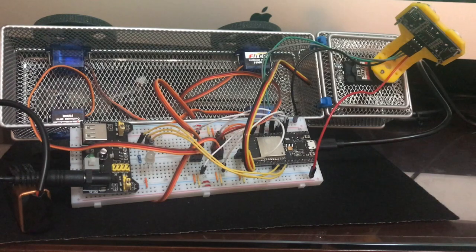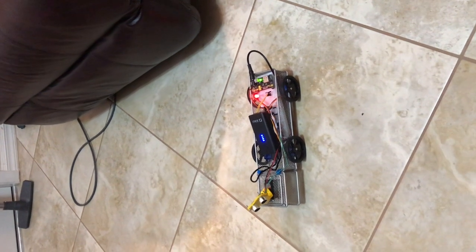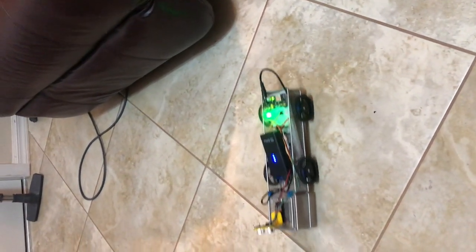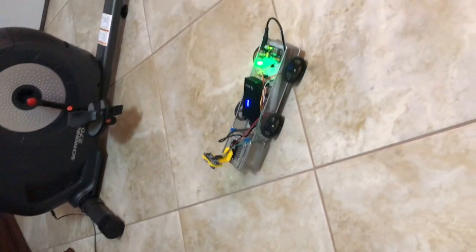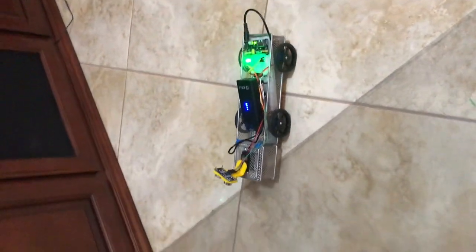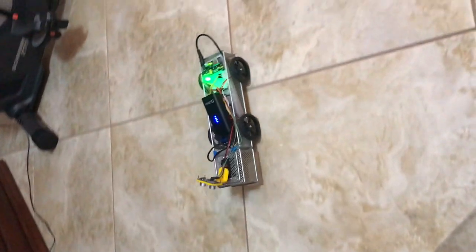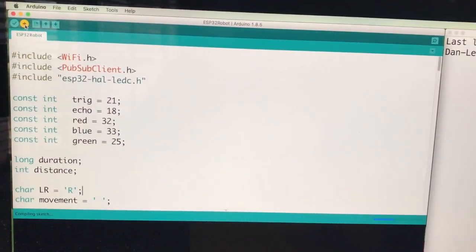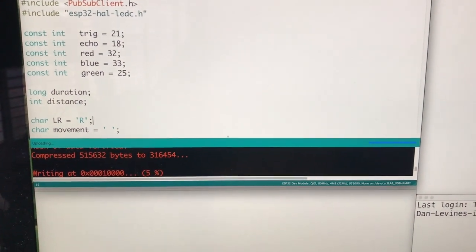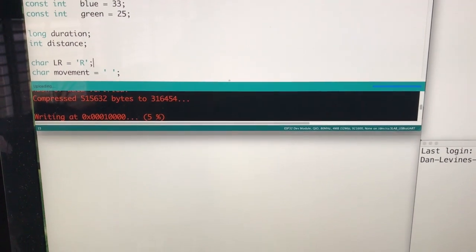Before I show you messages going from the Raspberry Pi to the ESP32, I'm going to show a quick demo of the prototype. The LotBot prototype has an LED indicator that turns red at power up, blue when it is connected to the Raspberry Pi Wi-Fi access point, and then green when it is connected to the Raspberry Pi MQTT server. This is a quick demo to show that this ESP32-based prototype supports four servos for movement and a fifth servo and ultrasound sensor to avoid obstacles. I am going to load the code to the ESP32 prototype to show the Wi-Fi and MQTT start-up messages in the serial display.